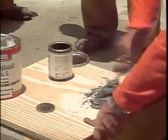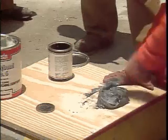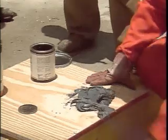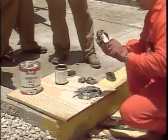Philly Bond Blue 6A and Philly Bond number 6 are high compressive strength epoxy putties, either of which may be used to securely fasten the jack pads to the concrete foundation. Apply a generous amount of Philly Bond onto the jack pads.